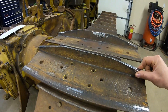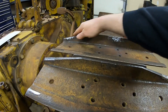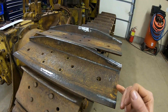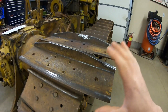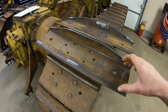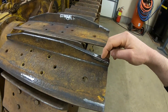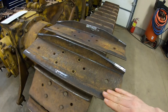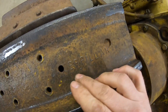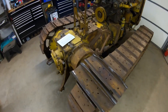One person asked if these were for snow rather than dirt. No, these are made for dirt — they came with the grouser bars beveled like that on each edge from the factory. The shiny spots you see are from the past life of these track pads. These actually came off a Vaughn track kit for John Deere combines for operating in low, marshy areas — that's why they've really never been in dirt much. For even more flotation, they had welded C-channel onto these, which has since been cut off before I got them. I just flushed those old welds and cleaned everything up.